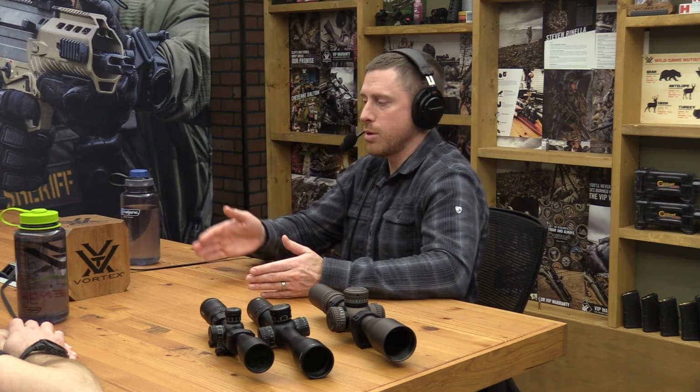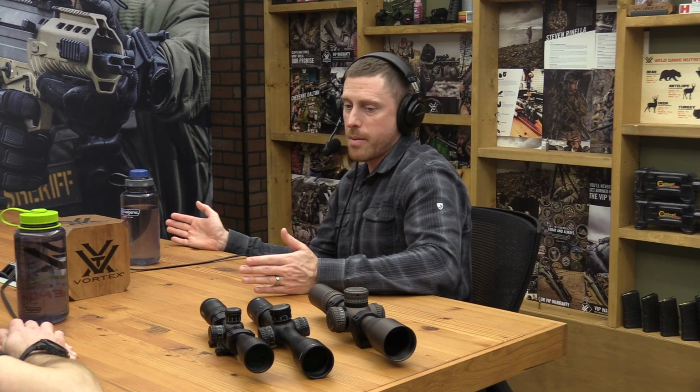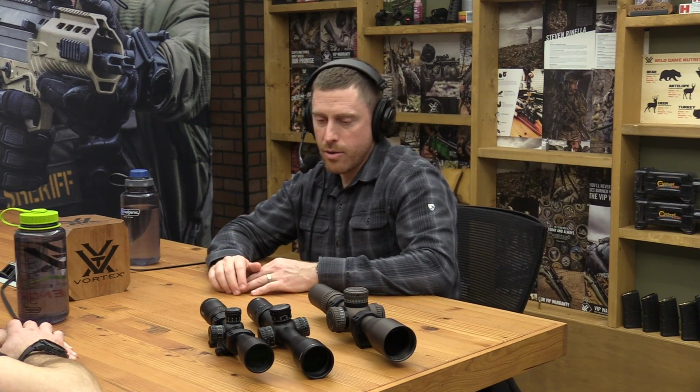There's a chance that two could be close enough to the same focal length, but that would be by pure chance. Typically when you're designing, you're going to let that focal length float somewhat. You might have certain focal length goals for various reasons, but you're not going to try to match your whole lineup to the same focal length so you can use the same reticle. It'd be impossible to do.